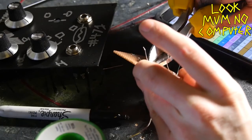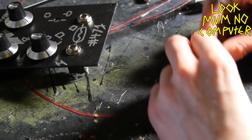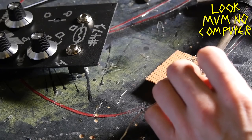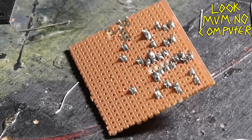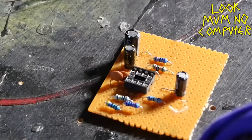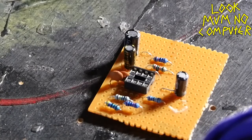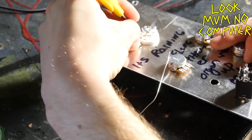Now it's time for the stripboard — the bigger the better, because if you make mistakes you want more room. Get a drill bit to break the copper strips underneath. Pop in the IC socket and solder it. Start with the six resistors, popping them in where they're supposed to be — maybe use a Sharpie to mark the right places, solder them down, and cut those legs off. Use your phone to look up the color codes. These capacitors were optional because they're power filters that stop buzzes from bothering other modules, but one of them you do need — it's a polar one, so check the polarity of that electrolytic capacitor.